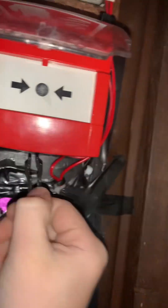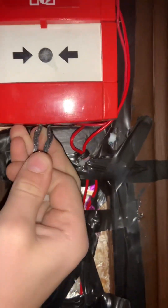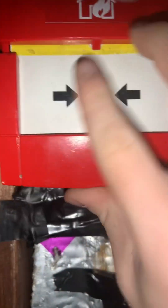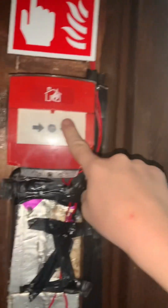I've also had some issues with the KAC call points because of this bottom lip. That little piece there is basically what holds the plastic in, and it wears over time — the plastic slides down and it just sets the alarm off. But there is a solution: just put a glass in and it usually works and doesn't set the alarm off. That's what I've done.